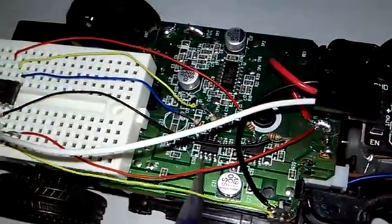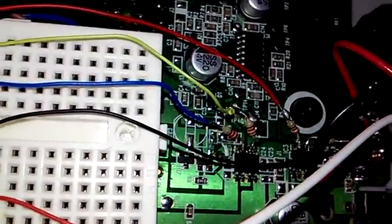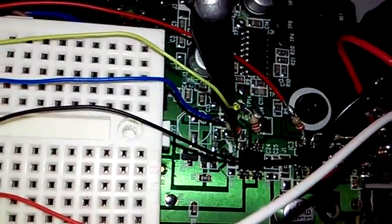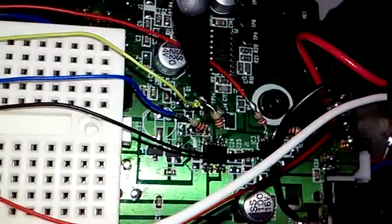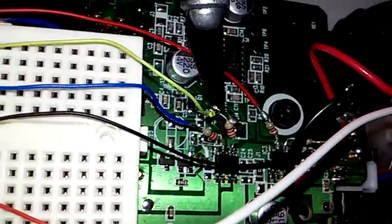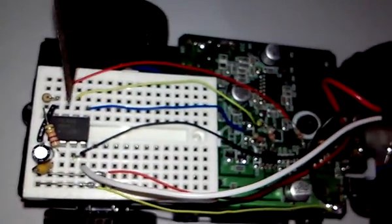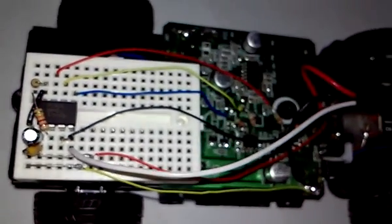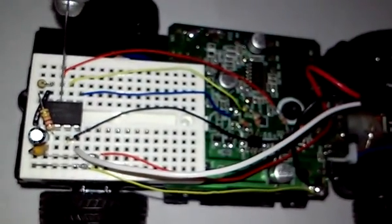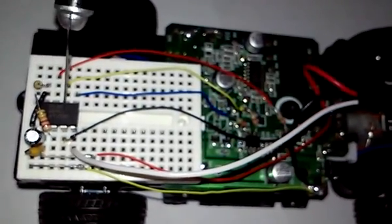Now here are the two black rectangular H-bridges you see right there. In this orientation, to the middle two pins on top I soldered a pair of 220 ohm resistors — there's two there and two over there. Then ran series wires up here to the PICaxe, mounted in a familiar 170-hole breadboard along with the support components for decoupling capacitors and the download circuit.